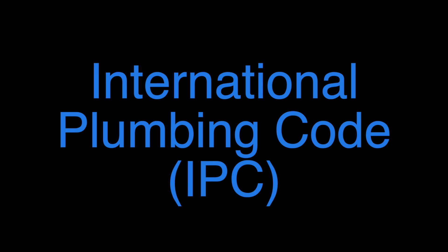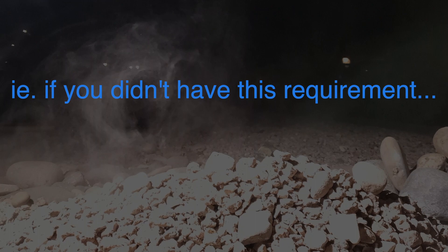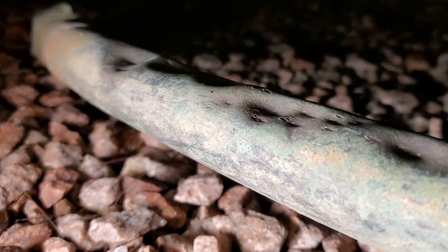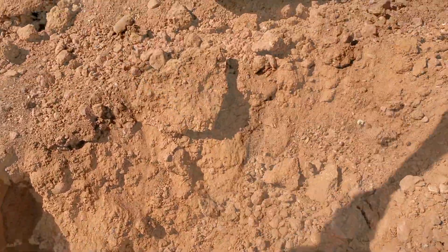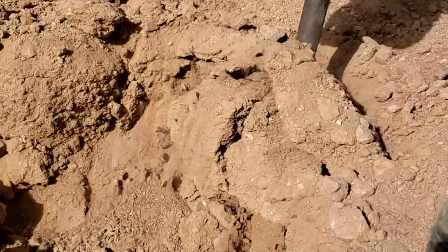Here's one last caution. If you look at your city's website, you may only see the requirement for tracer wire on water lines that are 2 inches and larger if they only link to the International Plumbing Code. But you may want to verify before foregoing tracer wire. Looking at this from a strictly logical standpoint, it just makes sense to have some indication of where a line runs out of sight — because when there's a problem you can't ignore, at least you have a means to find the line.